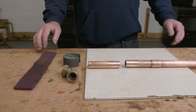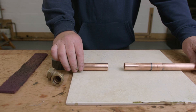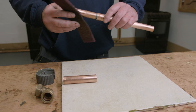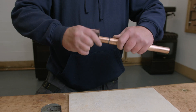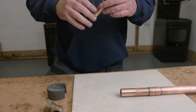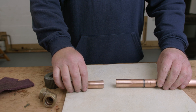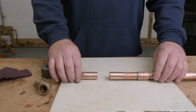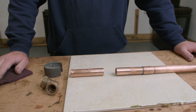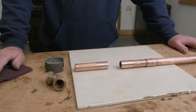The first thing I'm going to do is measure and cut the pipe, which I've already done. I'm then going to use the Scotch-Brite to clean up any rough edges on the pipework and make sure it's clean enough to accept the olive from the compression fitting. At this stage I'm happy that the pipe is clean, free of burrs, with no bits on there that are going to affect sliding the olive on.